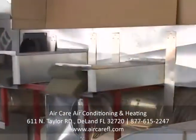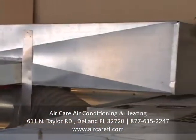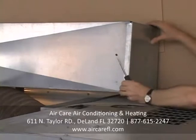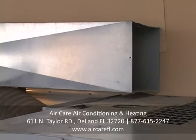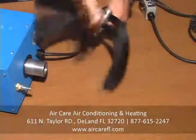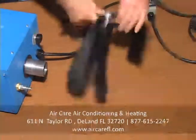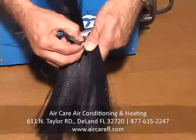In systems with a long trunk line, it may be necessary to remove an end cap and run the flexi brush down the entire length of that duct. The brush bristles are made of a durable nylon material, but if they do become worn, replacement bristles are available from Air Care at a nominal cost.